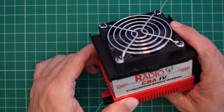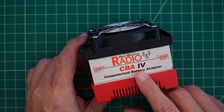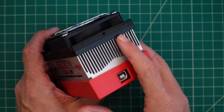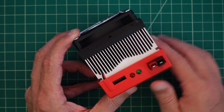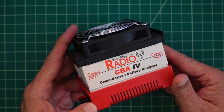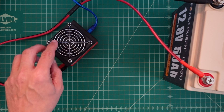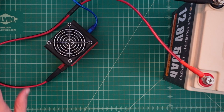We're going to use this device from West Mountain Radio — it's a CBA4 computerized battery analyzer. You connect the USB port to your computer and use the included software. Then you connect these Anderson PowerPoles to your battery. We're going to drain about 10 amps per hour, so we should have about a five-hour test. We have 10 gauge wire going from the positive and negative terminals into the PowerPole connectors on the analyzer, and the USB cable going from there into the computer.